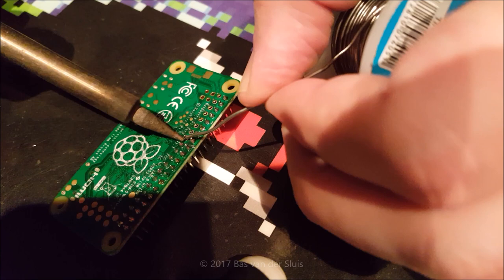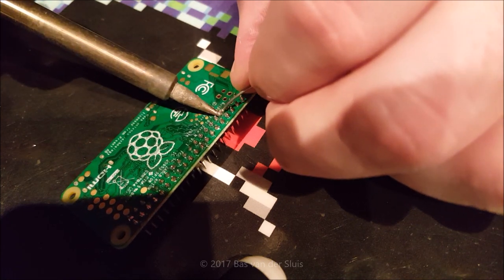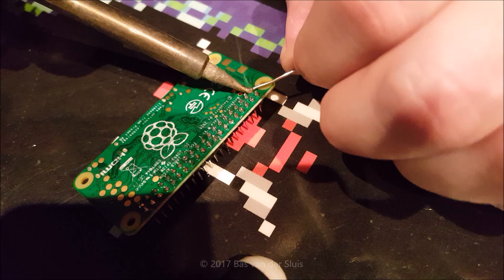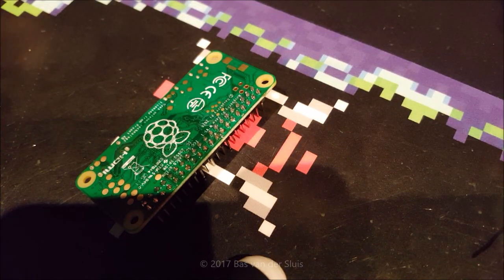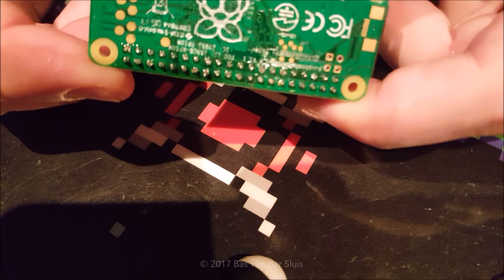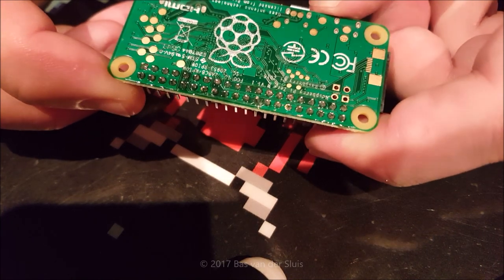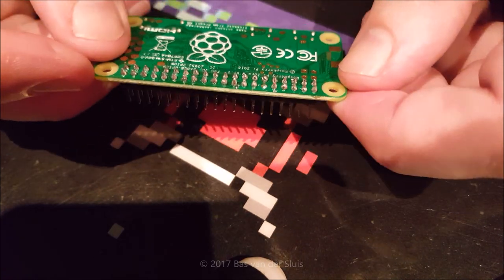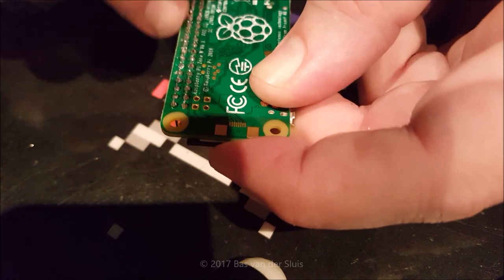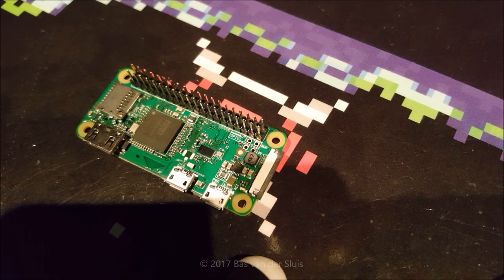Clean my iron again. Three more pins and then we're done. All the pins are on there. In case you're wondering, if you have a temperature controlled solder iron, mine was set to 370 degrees Celsius. Now it looks a bit messy over here but we can just scrape that away with our fingernails. Don't use knives because these lines are very thin and can be cut very easily. But it is done — now I'm going to do cool projects with this Raspberry Pi. Thanks for watching.